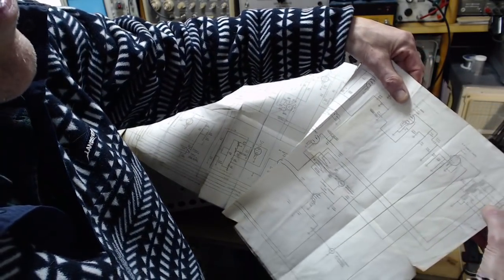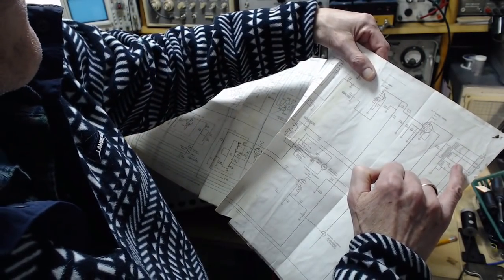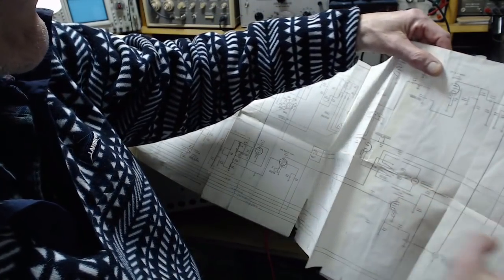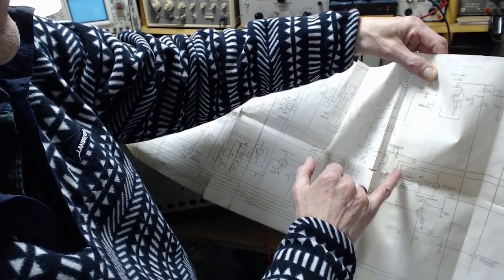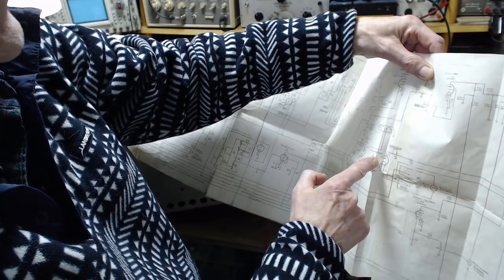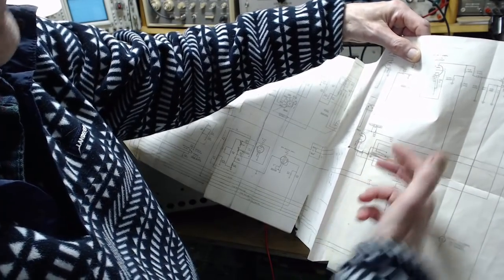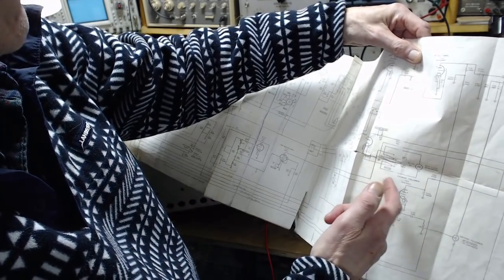So it goes over to the output of the audio transformer. The two outside pieces with the jumper in here. So basically, you throw the switch on the panel, the meter becomes an audio meter, getting its audio signal from here, rectifying it in this tube. Let go of the switch, it's a spring-loaded switch, the meter's always showing you the signal strength, and that's coming on these wires. Maybe something to do with this, I'm not sure.